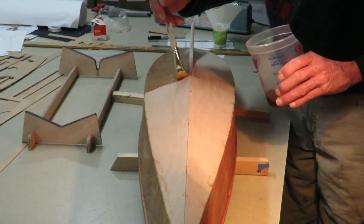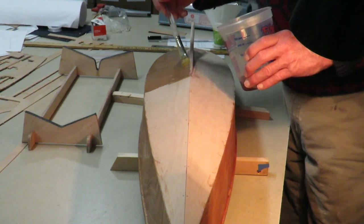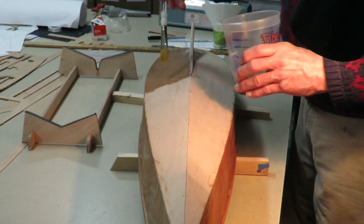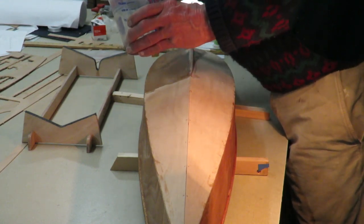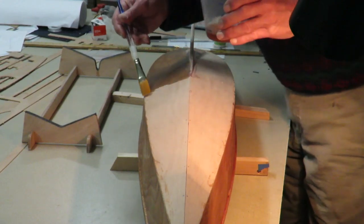Below 66 or so, your varnish is going to be sort of sludgy and cold and won't flow very well. So you have to thin it an awful lot. So it's not very ideal below 66 either. Although it's probably below 60 in here, but I've thinned the varnish significantly initially.